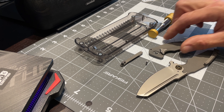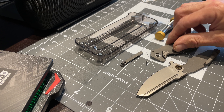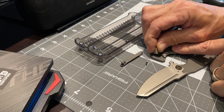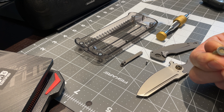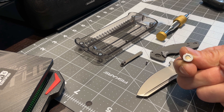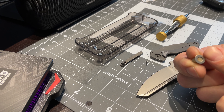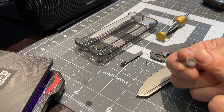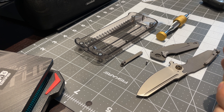I'll get that — I think it's this washer. Get a magnet. Yep, that's the one. See that line right there? I don't know if the camera can pick that up, but there is a little pressed-in line right on that washer — it's totally defective. So I'm just gonna put a new washer in there and put it back together.